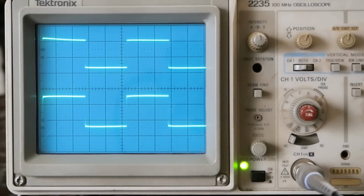So here we are at 1K again, and as you can see, when we turn the tone knobs, it has an impact. That's straight up. If you turn them fully counterclockwise, it's definitely affecting the tone curve. And to really be neutral, they need to be turned all the way to the right. Now let me turn off the tone defeat and show you. There's boosted bass, there's low bass, there's cranking up the treble, and there's turning down the treble. And I wonder if when Amir was testing this and had it on tone defeat, if he had the knobs straight up, you're not going to get a flat frequency response curve. I get it, I know it should, but testing these square waves has shown me that's not the case.